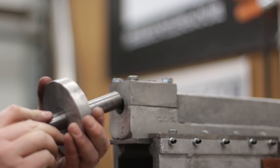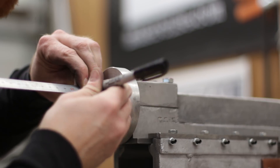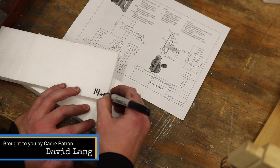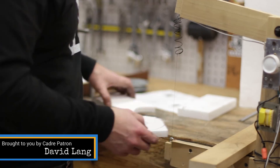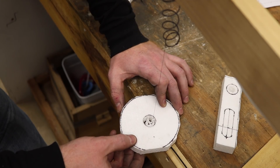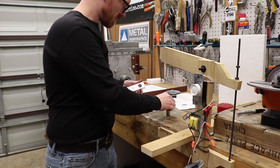Now that I had plenty of room across the length of that uniform diameter arbor, I went ahead and marked where the front of that pattern should be when I cast it onto the arbor. Then it was over to the hot wire cutter to start cutting the parts I'll need to assemble the pattern. I used the hot wire cutter to roughly shape the outside, but I also detached the hot wire from the spring and threaded it through the internal holes on these pattern pieces.